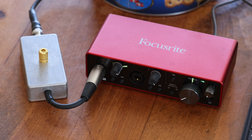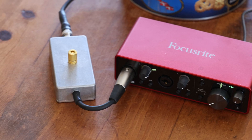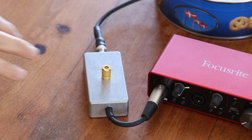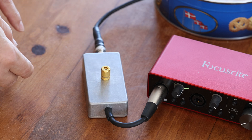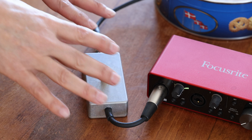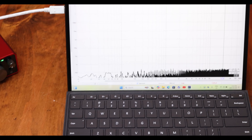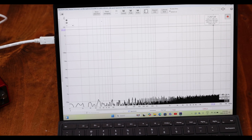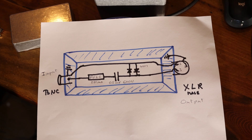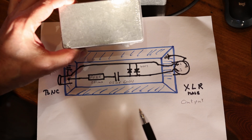To protect the sound card, you don't want to accidentally send it a five-volt signal or whatever — so we're creating a little device that's going to protect the sound card. This can be done for about five to ten dollars to make and it's really simple. You're also going to need a laptop that can run on battery, so you can avoid any noise, and the sound card connected to that laptop will also run on its own battery — keeping noise very low.